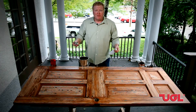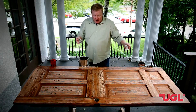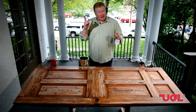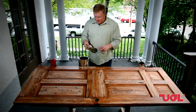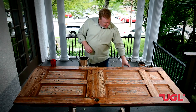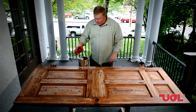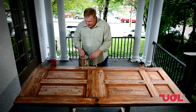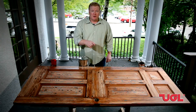That's the first step of doing this project and it really looks good. We've got two more steps — we're going to apply another coat of stain after this dries and then a clear coat, and you'll be amazed at how this looks. Now it's important to remember: all materials you use for staining have to be disposed of correctly. Put them in a sealed container — brushes, rags — put them all inside, add some water, make sure they're wet, and seal them up before you throw them away. Safety first.